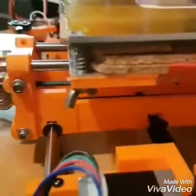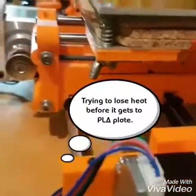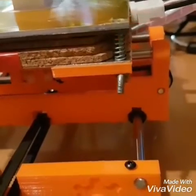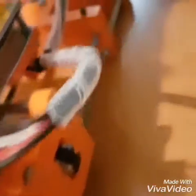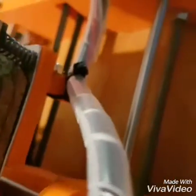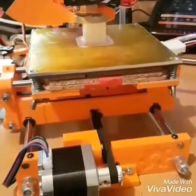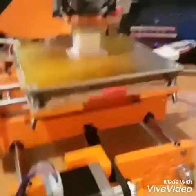I've got a lot of cork, metal plate, bigger springs, and wing nuts all helping to try and wick some of the heat away from the PLA hopefully. I've just tidied the cable onto the end stop there — what was going to be the end stop that I'm not using — to give it some strain relief, so that appears to be a lot better. Hopefully this will be 20mm cubed.